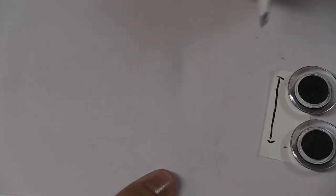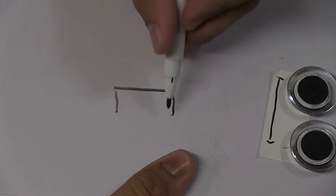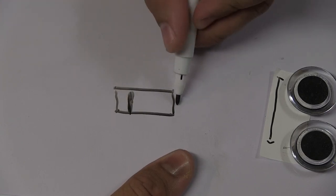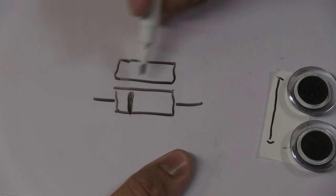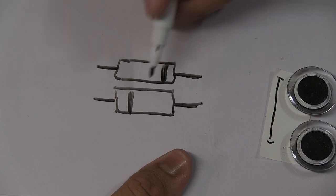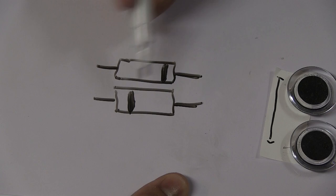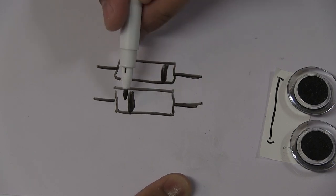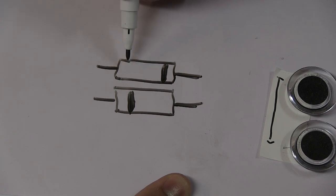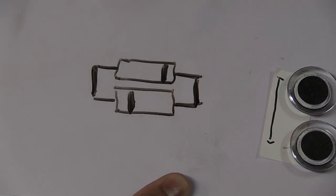Our distortion circuit is a super easy little clipping diode thing, and it looks like this. You have a diode - they look like this - and you have another diode right next to it that looks like this. On the diode, you will find some sort of line on it, and you just need to flip them around. So one diode is on one side of the other diode where it's no line, and the other one where there's no line on the other. Like this. These two you will twist together, and these two you will twist together, so they become one.